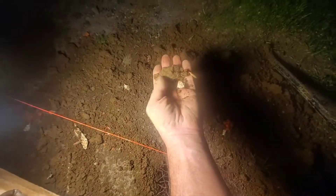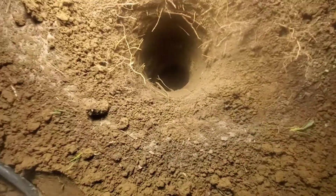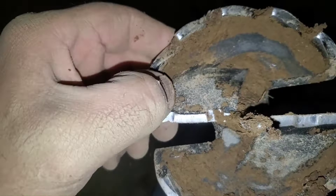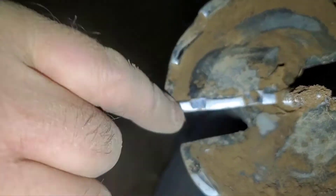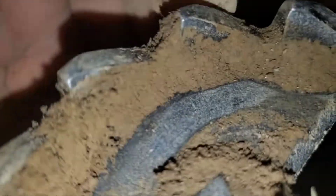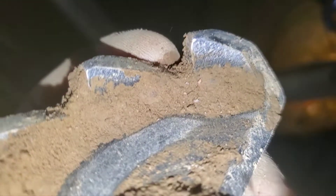Right now I'm getting into really really kind of packy clay-type soil, and there's down the hole right now. I've hit a few roots on the way down, which is no big deal. Here's how the tip is looking — just a little gummed up, but this thing is pretty unstoppable. The only thing I've really done was sharpen this edge a little bit: just take a flapper disc and kind of level it off, then put a little slant here and cut it straight. I'll re-face this a little bit and put a slant down it — you can see it's starting to get a little rounded.